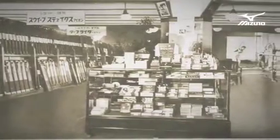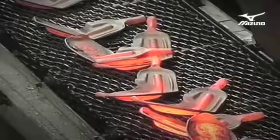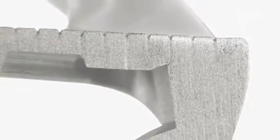The big difference between the casting process and the forging process: casting is from liquid to solid, and forging is from red-hot solid to cold solid. If you make golf clubs from the casting process, there is always some shrinkage, which is distortion. When it cools down to a solid, there are pinholes — what we call bubbles — air trapped in the product. Forging has none of that, so the structure is really tight and consistent.